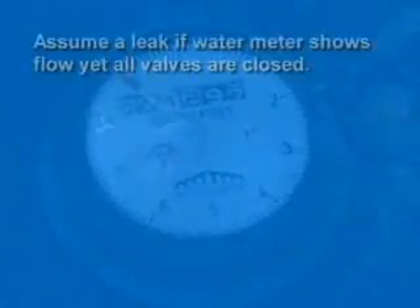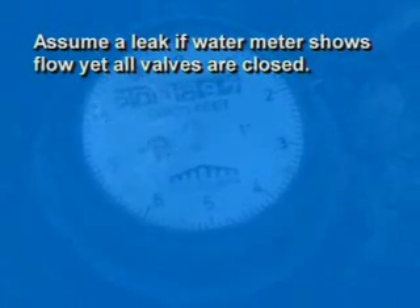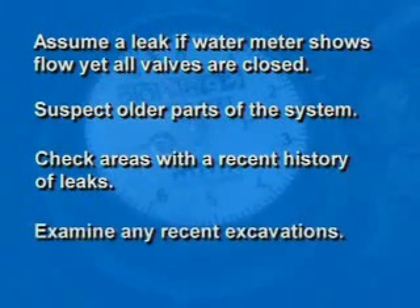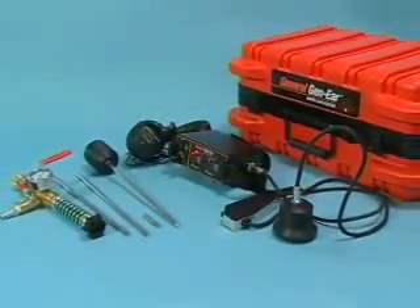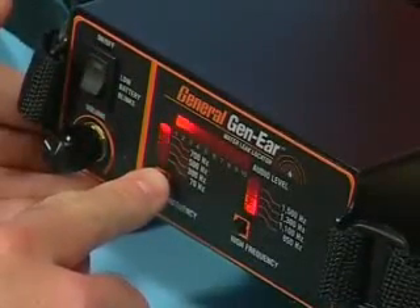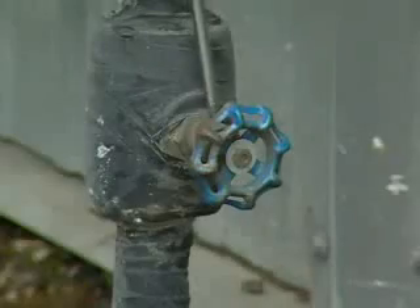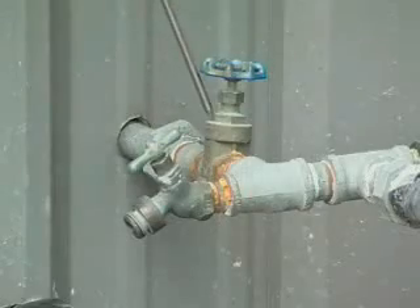The rest of leak location is a process of elimination. Assume you've got a leak if the water meter shows water flow yet all the valves in the house are closed. Suspect older parts of the system, check areas with a history of leaks, and examine any recent excavations. To conduct a water leak survey, start by setting the filters to 700 Hz low and 1500 Hz high — this is the most common leak sound frequency. Make direct contact with the probe sensor and probe bar to all sink lines, hot water heater lines, hose bibs, hydrants, and main valves.